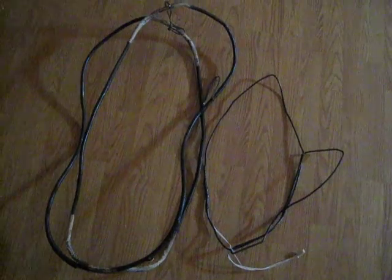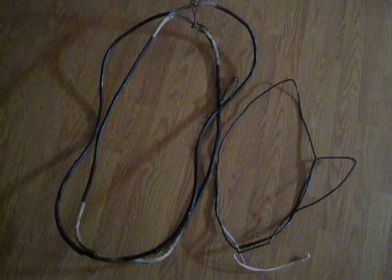This is a good way to get a lot of good magnet wire. You just take a razor blade and slowly go around the edges, cut into it, peel the tape back, and stretch it out on something to slowly unwind it onto a temporary spool. Get a little jig made and smooth out any little bumps you might have in it. It's a real easy way to get a lot of free magnet wire — just figured I might show this to you guys.